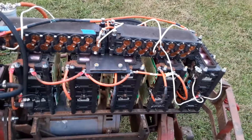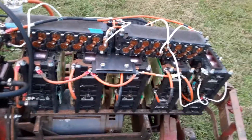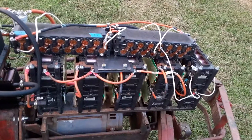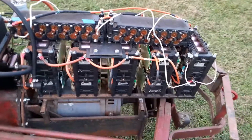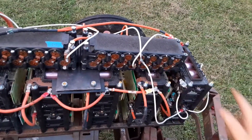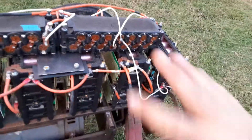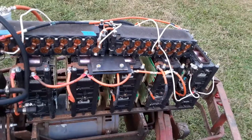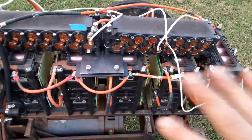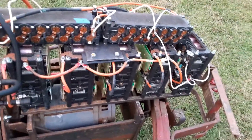I got the batteries for free — kind of a friend-of-a-friend deal. They owned a junkyard and couldn't sell them or throw them in the trash, so I took a couple pallets. I charged them up using a kind of Chinese, almost bird-scooter charger type deal — aftermarket generic chargers. I got a 58.8-volt charger because that's the maximum: 4.2 times 14. Each cell's low is 3.2V and max is 4.2V; 3.7V is the nominal. I charged up a couple modules after stripping them out of the big packs and they seemed to hold charge great and have a ton of power.